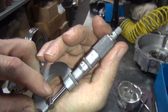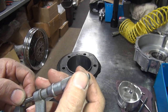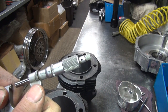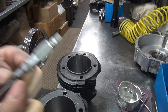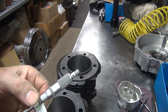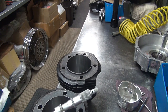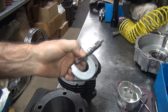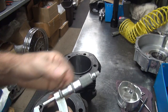I use a little bit higher tension. If I was using the little thumb wheel, it would probably be eight and eight and a half. Now this has grown by half a tenth because I've been holding on to this thing for about ten minutes. The longer you hold the mic, it warms up, and when it warms up it gets bigger. So it's not back at room temperature. All measurements tend to be at the standardization temperature — room temperature is the best. Lay it down for a few minutes, come back and measure it again, and that would be the number you'd use. If you hold the mic too long, your numbers get off.